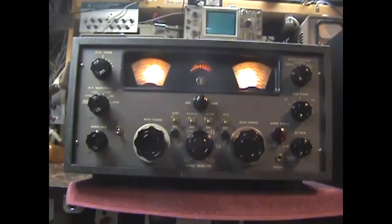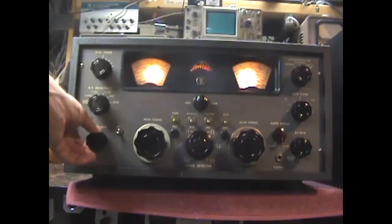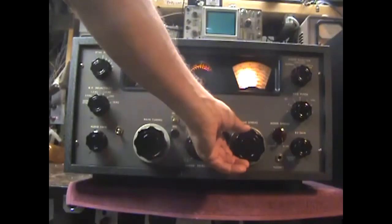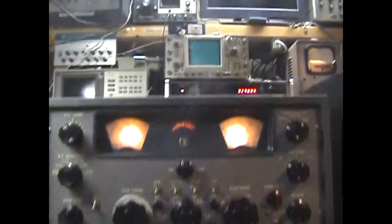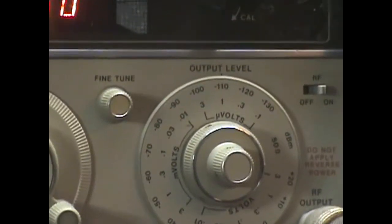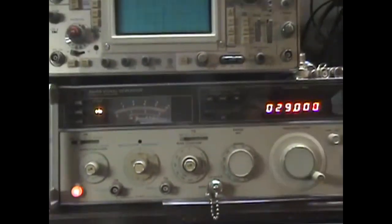The overall cabinet is in really great shape. The receiver works well from the broadcast band all the way up to 10 meters. Apparently this is on 10 meters copying a 1µV signal, which a lot of receivers this age don't come close to copying. That signal is being supplied by my HP signal generator right here. You can see it's on the 1µV scale, and the meter is right there at 1µV — that's the signal we're feeding into the receiver.